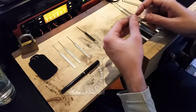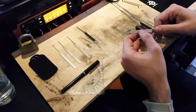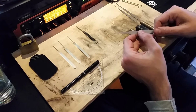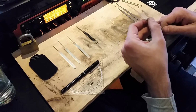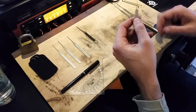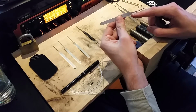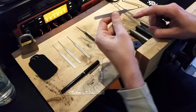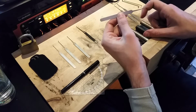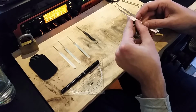It's one of my favourite hooks. There was a certain lock I was working on that really wasn't working for me, and I ended up putting way too much pressure on it, and it bent the pick away from the direction that you put pressure on. The problem with doing that is that when you now insert the pick, the hook is not actually touching the last pin. You have to bend it in further, and in doing so you might be actually upsetting some other pins. So I'm going to have to try and fix this one, and I'm going to be using a vise to do that.